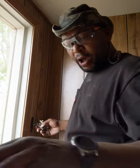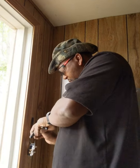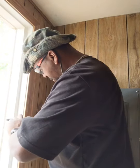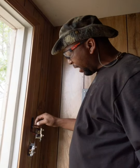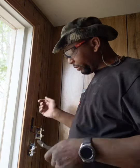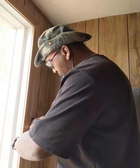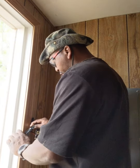It's a heavier gauge wire, so you kind of got to manhandle it a little bit. Not too much, but it's a little tougher than the ground. One of the things that I worry about with these wires is that I don't like too much coming off, because if they ever touch, well, you know what happens next, and we don't want that. So I try to cut enough that I need to put around the contact screw and use as much of it up as I possibly can, so none of it's really exposed too much.